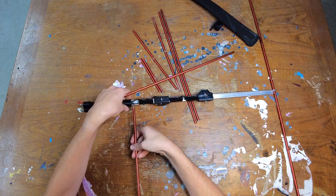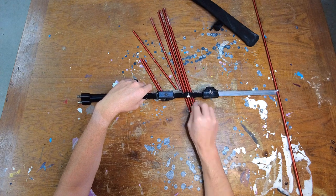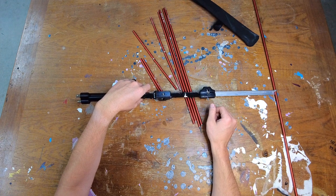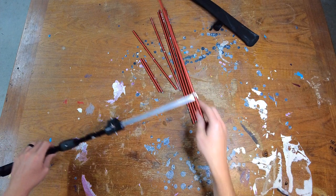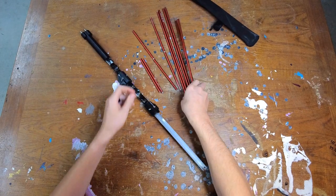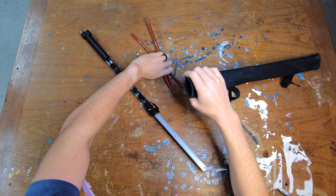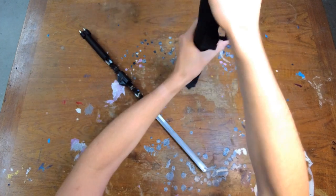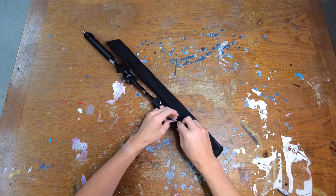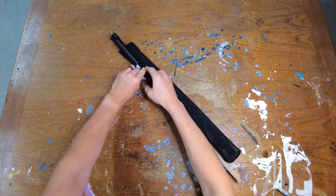The main reason I couldn't go with the traditional Arrow antenna design is I wanted the antenna to break down compactly. That extra little leg on the Arrow with the sliding connector means you'd lose your tune basically every time you break it down and have to retune when you reassemble. This isn't the fastest thing to do, but it definitely doesn't take too long to break the entire antenna down and store it in a packable form. I made this nylon case — I just slide all my elements in, shake it down, and it closes with Velcro. I also have Velcro tabs to attach it to the beam so it stays as one nice, easily transportable package.